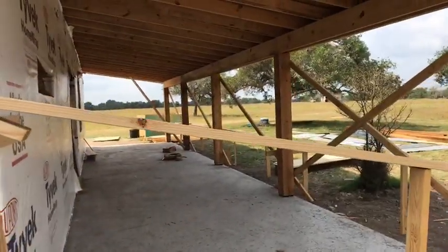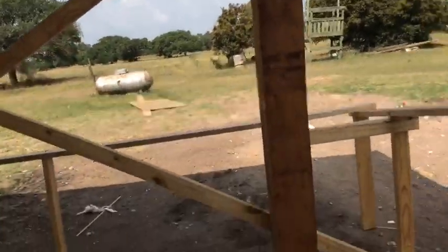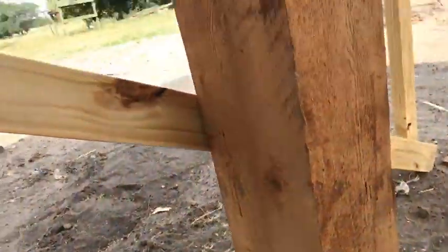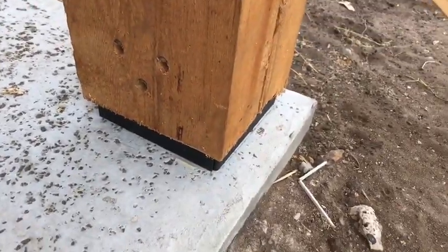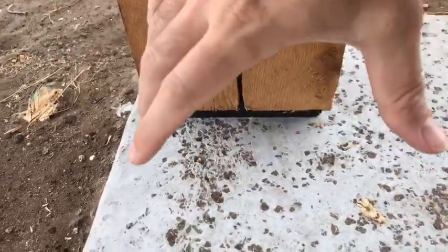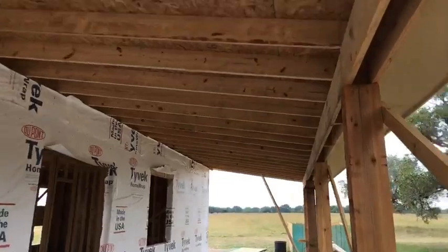Let me show you the back patio. This is a 48 by 12 foot patio, again all with solid 8x8 cedar columns. A really neat detail — very commonly you see galvanized straps that come up on either side of your columns, which isn't the prettiest thing to look at. What you're seeing here is a concealed post base. You've got a metal post base, you slice the side of your post, the post slips onto it, and then you've got three pins that you drive into the side to anchor it down.